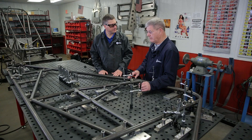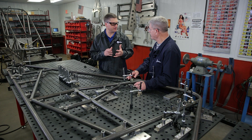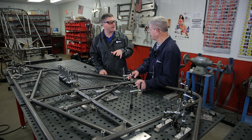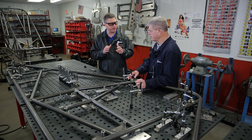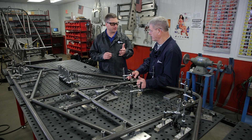We've experienced that the 4130 is probably a little more critical. The Dokol — we weld it in the same procedure and try to fit both pieces up as precisely as the other. But using really close to the same procedure, the Dokol seems to have, in the end result, a better stretch and pull than the 4130. That weld joint — the Dokol high-strength steel isn't as sensitive in the heat-affected zone. That heat-affected zone doesn't become brittle after welding. It still maintains that stretch, which is important in a crash or an impact, because the Dokol will stretch more and actually forgive more than the chromoly tubing.